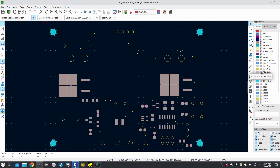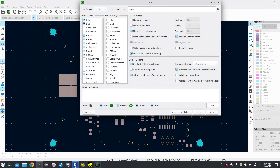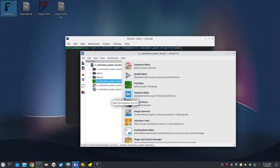The other layer is the edge cuts. Whether you include it depends on your clamping strategy — for me, I do include it. To export those as Gerbers: go to Plot. We only need the front paste and the edge cuts. That wrote them out as Gerber files, and now we need to take those Gerber files and convert them into a G-code file that the CNC machine can understand.